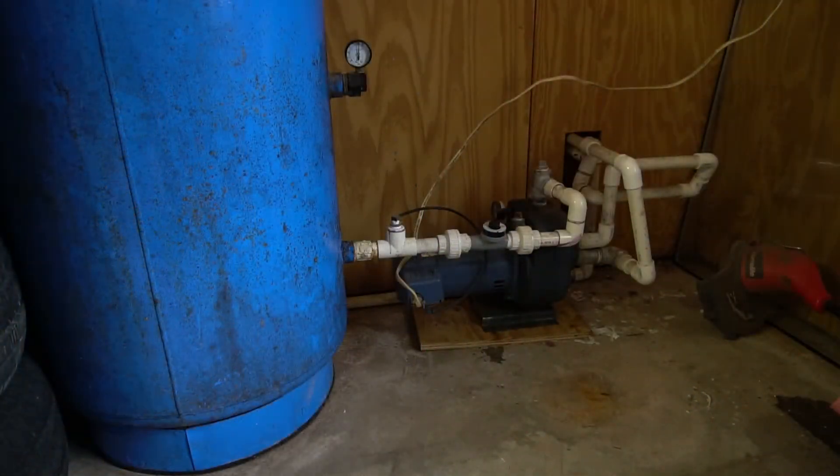There's a good example of a completely waterlogged tank that's going to burn your pump up. And as you notice, the bearings are squealing pretty good — not extremely yet, but it's getting there.